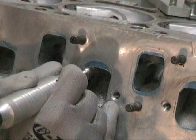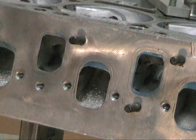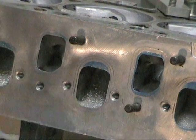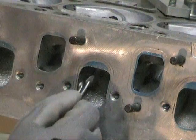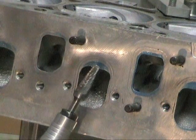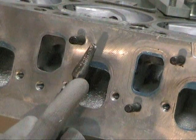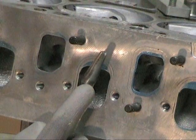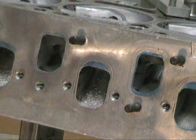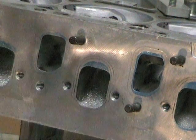These aren't carving knives. Especially when you get down to using a right angle with these little eighth-inch shank burrs, or even the longer shank eighth-inch with a straight handpiece — you want to use these things like a paintbrush, brushing away the metal, not gouging. It may work, but it doesn't work well and has problems. On quarter-inch shanks it's not as bad, but you can start to bend the shank and the burr can get off-center. On eighth-inch burrs, you can bend those pretty easily, and even the longer four- and six-inch quarter-inch shank ones. There's no need — you're not in a hurry. Take your time to get it done right.